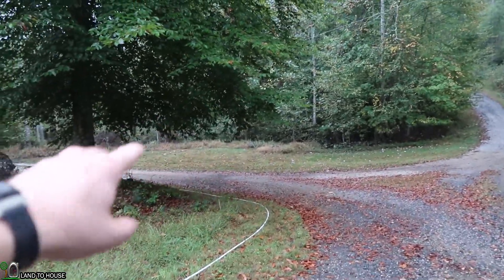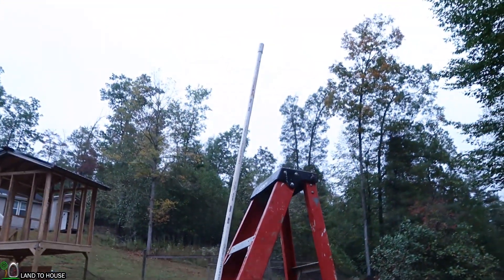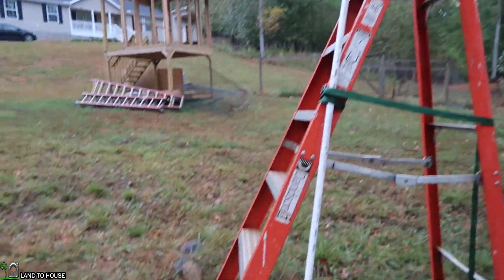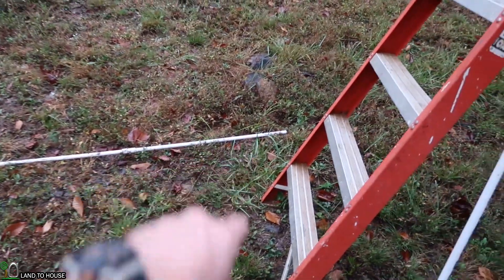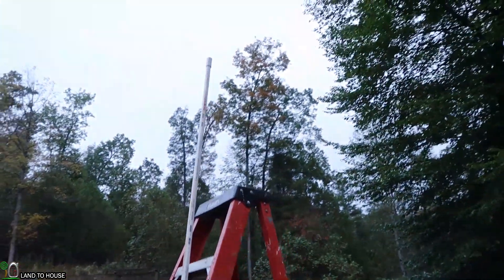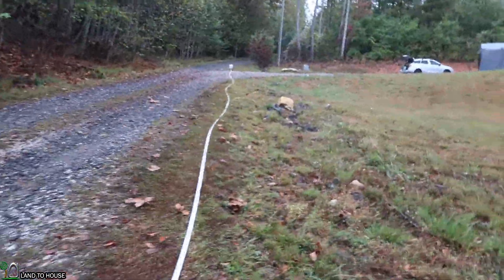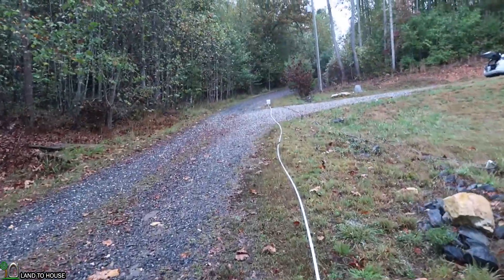This stand pipe location is 60 feet out from the pump. The stand pipe is just an open pipe that sticks up above the source. I'm notoriously bad at judging height, so I've moved up to a 10 foot piece here. Now we're going to open up the supply line, which used to be the drive pipe, and let this fill up and start our test again.